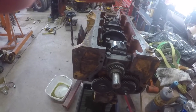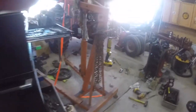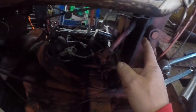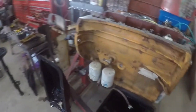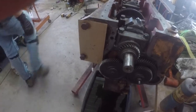One of the things we're missing on this block is that the 870 series tractors have 100% hydraulic steering while these have hydraulic assist. We have a steering shaft that goes through here, through this carrier, then shoots down and goes through this hole in the block — but this block does not have that hole. So it looks like I've got to get the hole saws out, do some accurate measuring, get it in the same place.